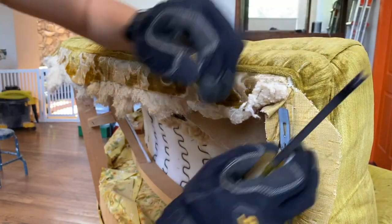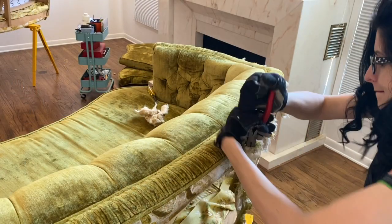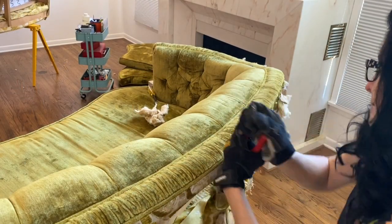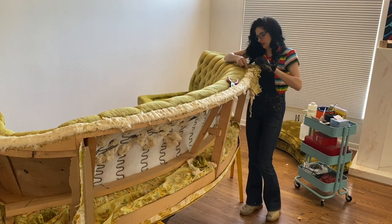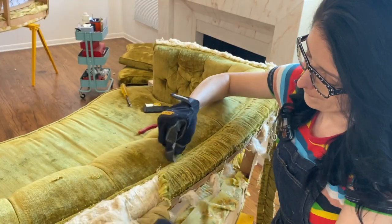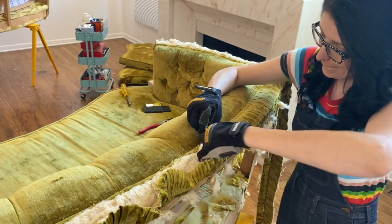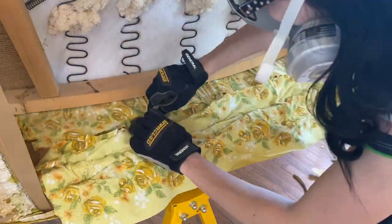Next, remove both the padding and the cardboard backing from the sofa's outside back. Then it's time to start the lengthy removal process of tack strips and upholstery staples, using both the staple remover and needle nose pliers interchangeably as needed. These three steps are pretty much what you do again and again for the entire tear-down process — work your way from the outside back of the furniture, slowly releasing each part of its past upholstery fabric, including the attachment of both the inside back and the inside seat.